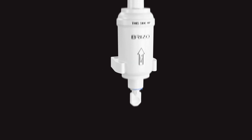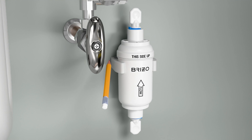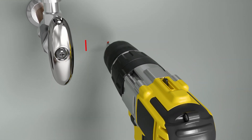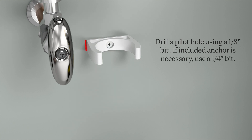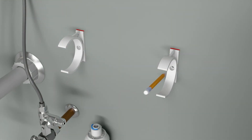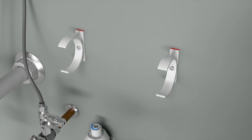Place the pre-filter in a provided C-clip and locate the ideal spot to mount it. When choosing the placement of the C-mounts for the pre-filter and remineralizer, be sure not to drill into any plumbing or electrical systems behind the walls or into appliances and adjacent cabinets. Mark the location for the C-clip, remove the filter from the clip, and mark the pilot hole. Depending on your wall material, use the appropriate provided hardware to secure it into place using either the provided wood screws or solid wall anchors. At this point, you can leave the pre-filter out of the C-clip. If installing the optional remineralizer cartridge, repeat the same steps using two C-clips, ensuring you have clearance on the top and bottom to attach an elbow and tube in a later step.